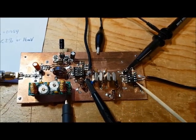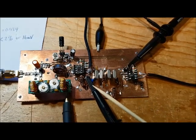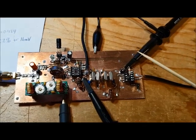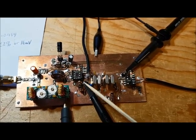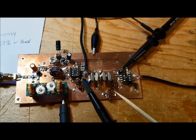I've got a 1500 ohm resistor between the input to this SA612 and ground. So the crystal filter is going to see 1500 ohms and it should be happy. The measurements I'll be making are with a scope. Here I've got scope probe one and scope probe two connected — probe one to the input of the crystal filter and probe two to the output of the crystal filter.